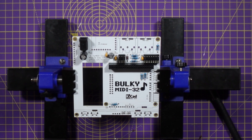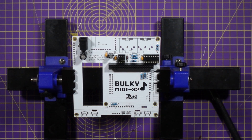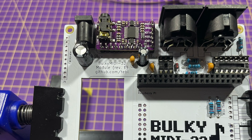The next two items to add are the connectors for the audio interface. This build uses a separate audio stage, because the one built into the Pi is not really fit for purpose in what is, after all, a specialist audio project. So there are my pin headers soldered into place, and then we solder the audio interface onto the board. But before we solder it in, we need to set some jumpers. The settings will depend on the type of audio interface you buy — I recommend getting the one listed in the bill of materials on the GitHub link. We set the jumpers by bridging the solder pads, then stick the board onto the pin headers and solder away.